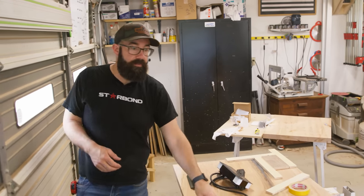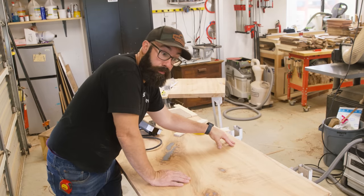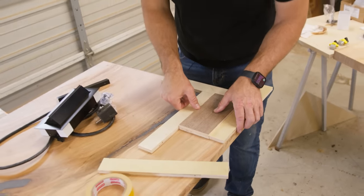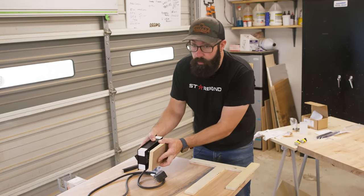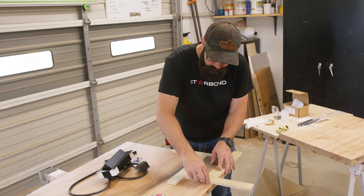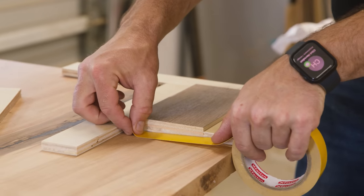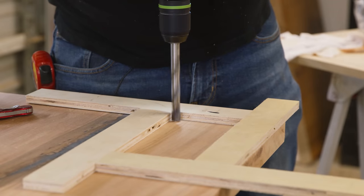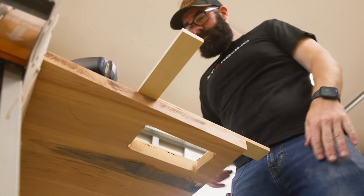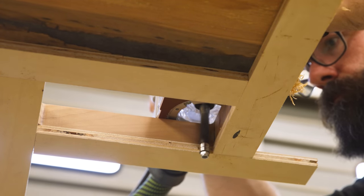With the panels in clamps, I wanted to start working on the desktop, which is going to have some really cool features. First, there's going to be a power cord pass-through — a cool design I've used on another project. The other thing is this pop-up power grommet from Doug Mockett Company. I'm making what I call a perimeter template: I've made a little block of wood as an analog for the pop-up power grommet, building a perimeter template around it so I can remove all the waste when I take the piece out. I'm using double-sided tape to hold it down. I want to thank Doug Mockett Company for sponsoring this video — I've been using their products for a couple of years, but they've been in business for over 40, offering drawer pulls, pop-up grommets, table legs, and more.